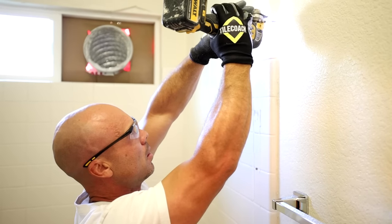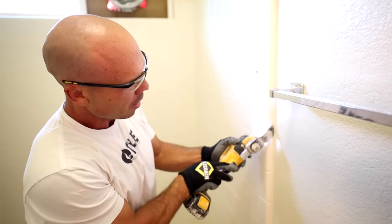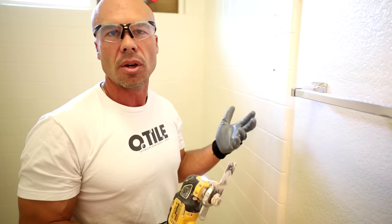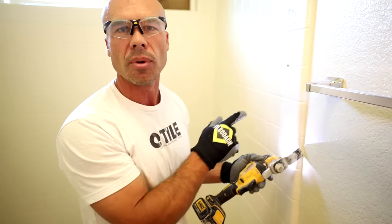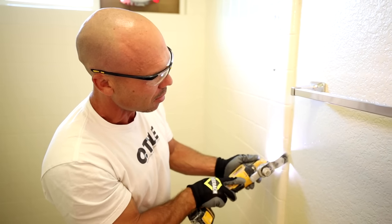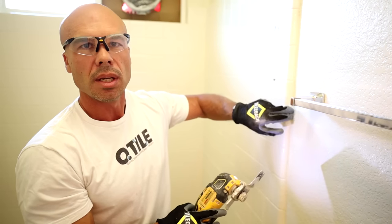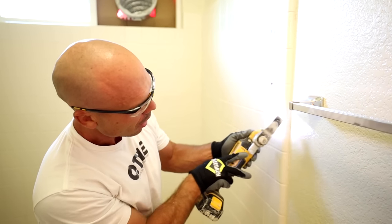I'm going to go across the top now. The way I do it with the buzz tool - you can see I'm putting it at an angle. I'm really only concerned with going the half inch through the drywall. You don't even need to go the full half inch - if you get most of it, say it's half inch drywall and you're only cutting three-eighths into it, it's still going to break off clean. If you try to stick it straight in, it doesn't have the nice cutting angle. And if you hit a stud, it'll just kind of ride on the stud.